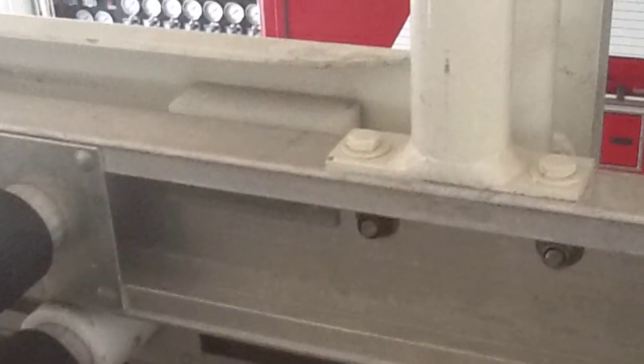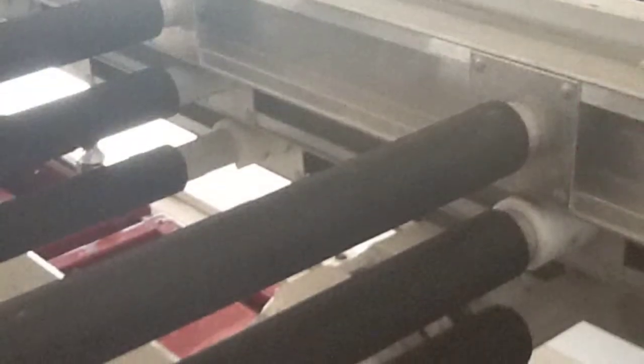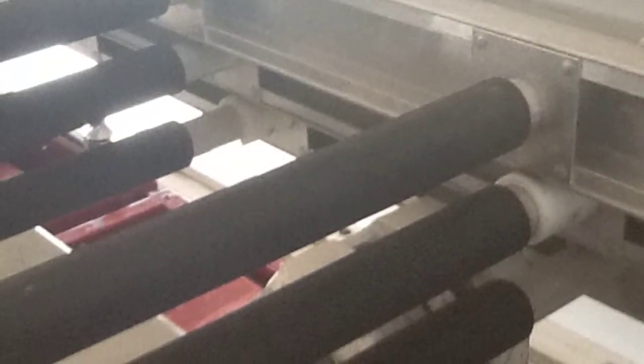The air cascade system on 6415 is not to be used. We don't have the tank tested any longer, and we don't put anybody on the end of the ladder, so they have to be in that kind of air supply where they have to plug into the truck. The other checks you should be doing when doing the monthly check is looking at all the rails, look at the rungs, make sure all the bolts and nuts are there, make sure nothing's out of the ordinary, and if it is, report it to Ron.